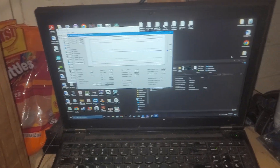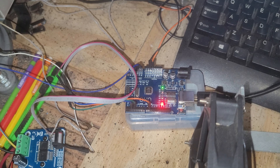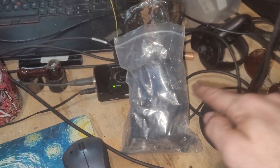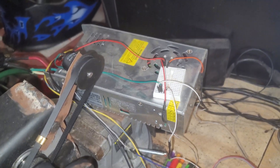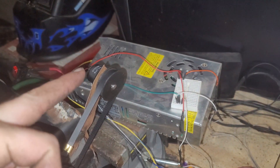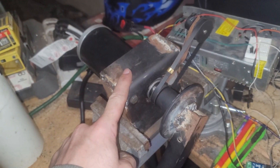We have one Arduino set up there connected to my laptop, just running SMC3 so I can see the position of the arm. The IBT2 is right there — those get changed out as I'm testing a bunch of them; I've got three more to test. Then there's a 24 volt 25 amp 600 watt power supply, and a breadboard for the positive and negatives for the potentiometer and IBT2 running to the Arduino.